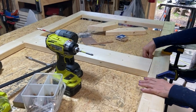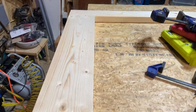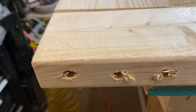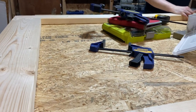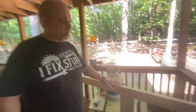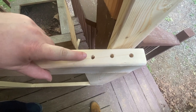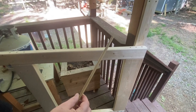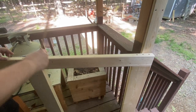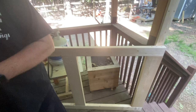While you weren't looking we built the door frame, and here it is on our large assembly table. I was initially planning to use dowels for the joints but decided to use screws which I recessed, so we don't need expensive long screws. Since this is a two-by-four construction it would require very large screws otherwise. We assembled the door and now we're going to fill the recesses we made for the screws using dowels as plugs.